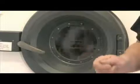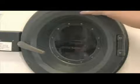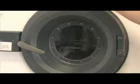It extracts as much liquid as possible, but then it will heat up to 175 degrees, which turns the perchlorethylene into a gaseous form. And then it goes to the refrigeration unit, turns it back into a liquid, which will then go into one of our holding tanks to be reused later.